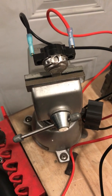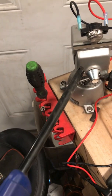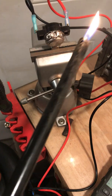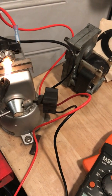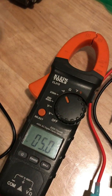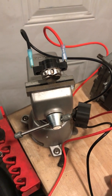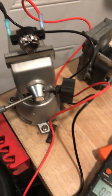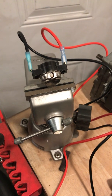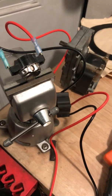So the best way to test this using a barbecue lighter is just to apply some heat onto the area that is connected to the exhaust blower housing. And as you can hear from the beep, the switch is now closed, so this low limit switch is working properly.